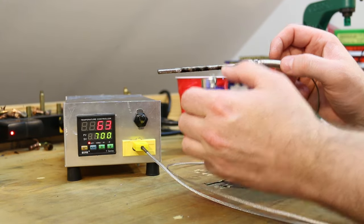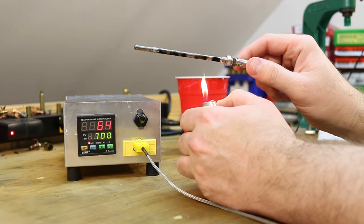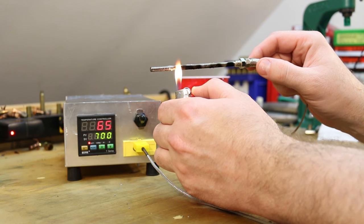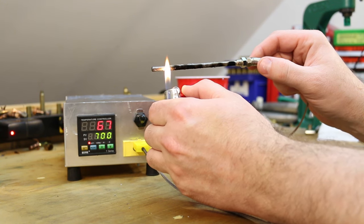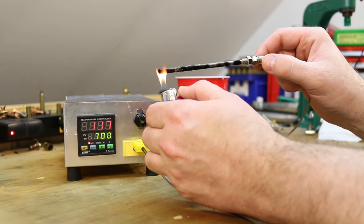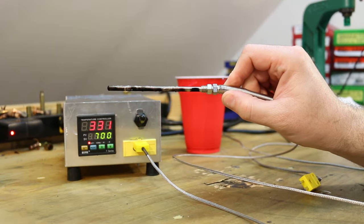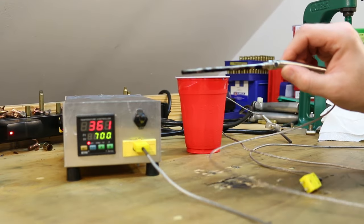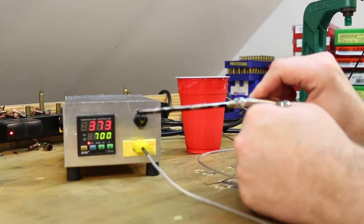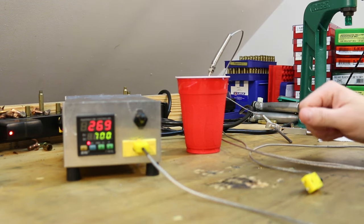None of the wire along the length reacts. These react pretty fast so I'd expect it to show quickly. There we go — starting to climb. And then at the tip — there it goes, climbing very rapidly. So it looks like the thermocouple junction between the two wires at the tip is really the only part that matters.